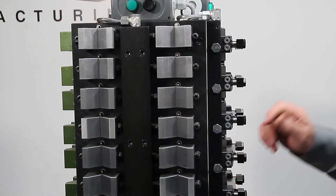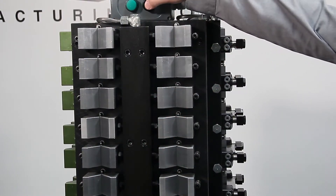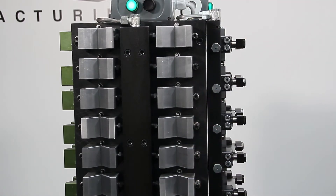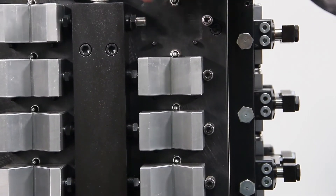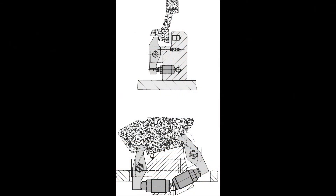These clamps can be mounted using individual blocks and feeder caps, or they can be placed very close together in a manifold like this example here. With the push of a button you can clamp all these push cylinders at the same time, and they'll all have the exact same clamping force on your parts. You don't even have to have a part in all stations. In this example the plunger is used to crowd and clamp the part against a fixed stop. You can also use them to drive your own custom linkages.